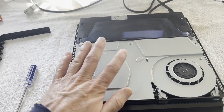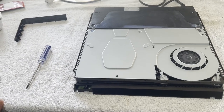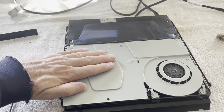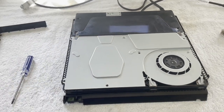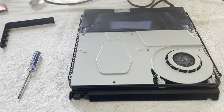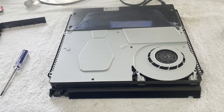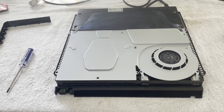I'm guessing maybe we have an intermittent power supply issue here. It did turn on, it did run — I don't think there's anything wrong with the main board. It ran for quite a while and ran perfectly solid. It's only after I pulled the supply out. I just pulled it out and laid it over to get to the antenna lead. It wasn't broken — I just thought it was. It looked like it had been popped up there. So this could be an interesting one. Let me get another supply and swap it out.